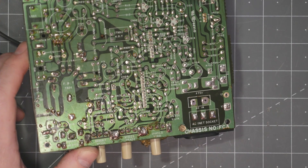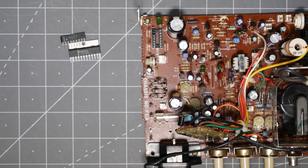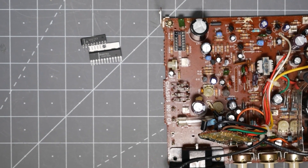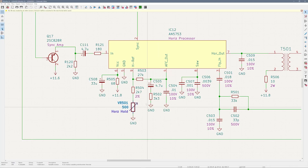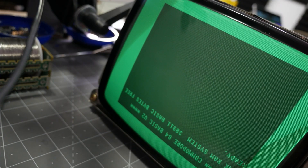For example, years ago I had an Apple IIc monitor that had a funky but stable pattern. First, I tried replacing all of the electrolytic capacitors. Then I sourced new old stock versions of the two amplifier ICs on its control board. But it was not until I sprayed this potentiometer with Deoxit that the monitor started working again — and it looked great, even when it was upside down.